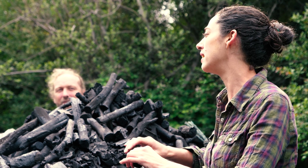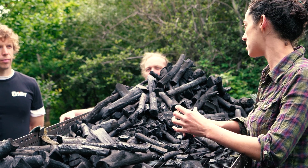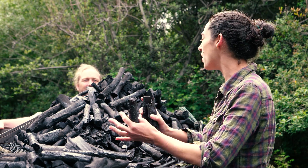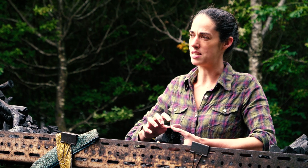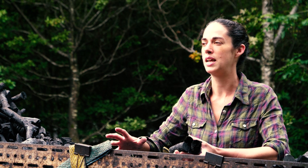Brown ends light really quickly, they're really dry and they're really hot. It's a waste product but it has its uses, because you'll never be able to convert all of the wood to charcoal - some varieties of wood convert quicker than others. We err on the side of a slightly brown-endy burn when we shut our kiln down, because it means the overall charcoal is better quality. If you let the kiln go over a bit and start burning away some of the charcoal, the end result is just lighter charcoal with not much left to burn, because it's already started to burn itself.